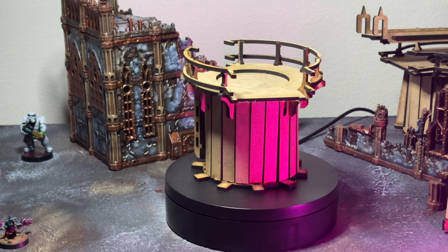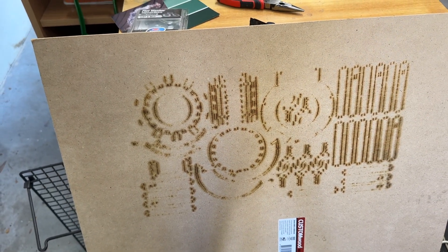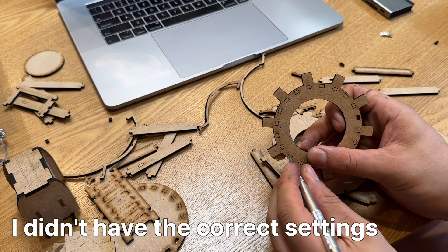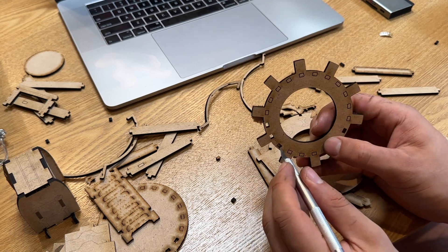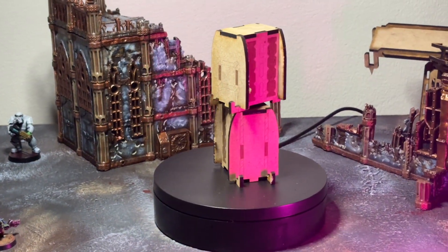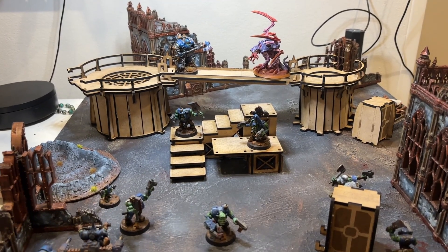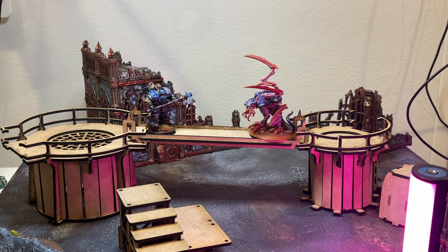In terms of my experience with the laser engraver on some of the projects I was going for — the first time I was trying to print this rotunda kind of thing from Bilbo Stomper. You can see it's not fully cut through, so it could probably use a knife just to scrape them out. It just didn't have enough power to cut through it, so the cuts weren't clean. I tried using a hobby knife to fix that up but it was just too tedious, so I just recut it and that worked out really nice. You really want to make sure you get clean cuts and nail down those settings. I really do like how the MDF terrain comes out — where the cuts are on the material, being burnt black, just kind of adds this nice vibe with the brown MDF color. And with the ash it's added some nice variations in texture. The terrain also has engraved flat areas, so if you think MDF is boring because you can't get texture, you can engrave detail and signage into it.